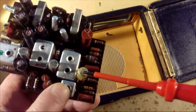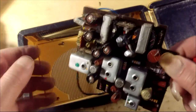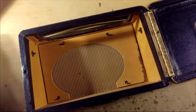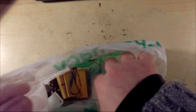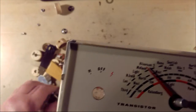I'm showing you these three AF117 transistors that are prone to failing in this model. I bashed one of them with a screwdriver and it brought the radio back to life for a moment, so I'm pretty sure that's the fault. I decided — either I fix it or I create a Bluetooth speaker, and a Bluetooth speaker would be more useful to me right now. I used to listen to MP3s in the garden by broadcasting them with my own little radio station, which was quite powerful — about 300 yards up the road — highly illegal, of course.